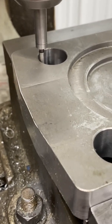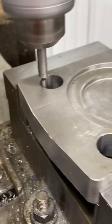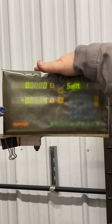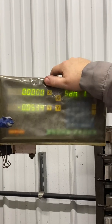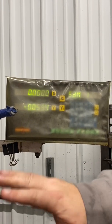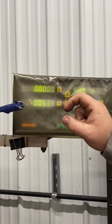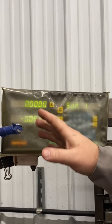I'm going to do it again — watch it close. There it is. Now, come up here by my digital readout and I'm going to zero it — which I just did. I zeroed it. Now you're saying, how do you know you're right in the Y? It doesn't matter in this case — it doesn't even matter whether you're bumping it off a 500 thou or a 200 thou block on the edge finder. You'll see why.